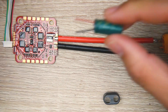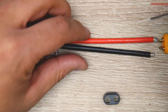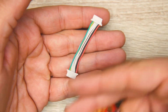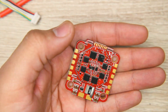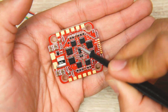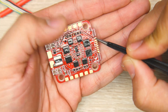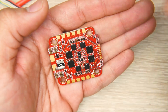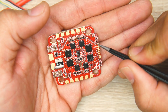Install the capacitor along with your battery wires. You must install this low ESR capacitor or you have a high probability of burning the ESC, especially running 6S or even 4S voltage. They also provide a connector you can cut up and solder wherever needed. Flipping it over, all the pads are broken out. There's an extra pad providing battery voltage — if your flight controller only takes 5V and you connect the VIN wire here, you will burn it immediately, so be careful.